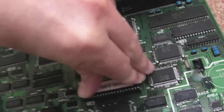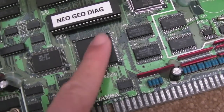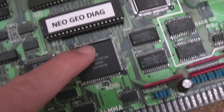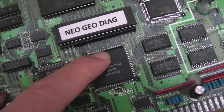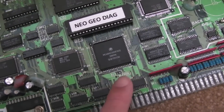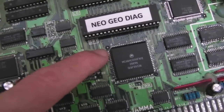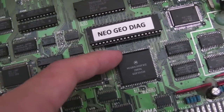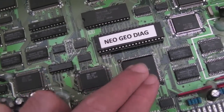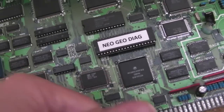With the PLCC sockets - that's the same sort of chip you'll see in those square sockets - the PLCC ones, the MMU and the GLU. You'll notice this has got a little notch there - that's just pin one. It's marked on the board, pin one, and you'll see a similar thing in the socket. You often find that these have got like a little bend on one side, and the socket will only have a little sliced-off bit on the corner to accommodate that, so you can only put it in one way correctly. Just make sure you've got it the right way before you push it back into the socket.